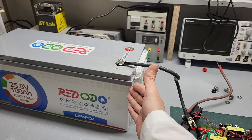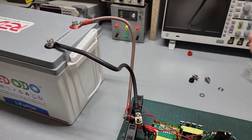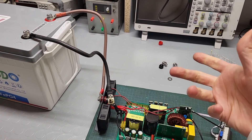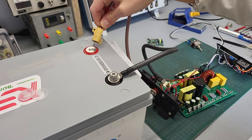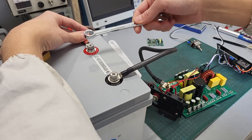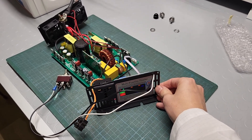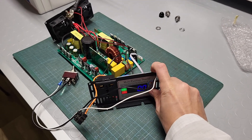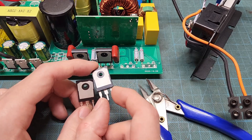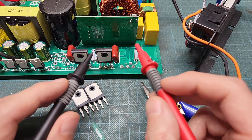Finally the real moment of truth — and honestly I'm getting tired of this inverter refusing to work. I hook up directly to the 24 volt battery. Did you hear the pop? It's totally normal — it's because there are a bunch of electrolytic capacitors on the board that need charging, so when the battery is connected big sparks happen. To avoid that you can use a power resistor, just a few ohms in series, to slow down the charge. Three, two, one — and no way! Still not working. I cut two more IGBTs out of frustration, but oddly they're not shorted. Checking with the multimeter, basically everything is shorted — most likely the gate drivers blew again.